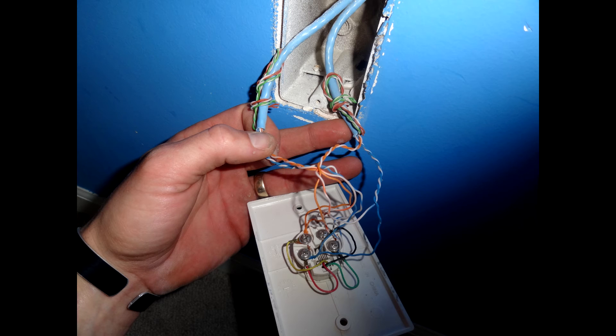The end of the line will probably be a back bedroom — there'll only be one line going to it because that's the end of the line. You cannot do that with internet cable. If you have ISPs going to it, you can't just tie into it like they do a phone line, because it sends and receives traffic and the device isn't going to know who to send traffic to — either to the computer or to your ISP. It's going to confuse it and it's not going to work. So you have to run individual lines, and the other line you just cut and don't use.